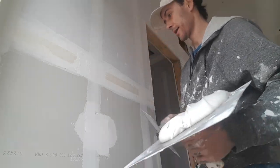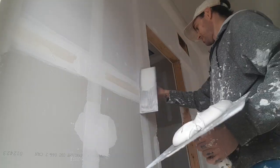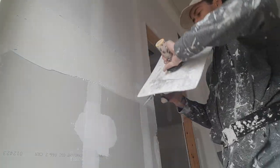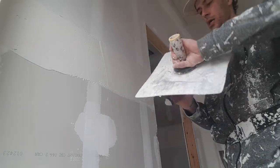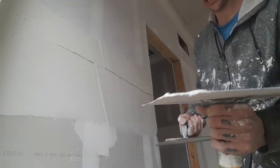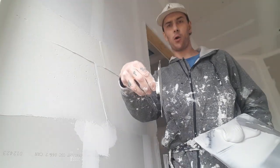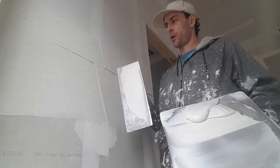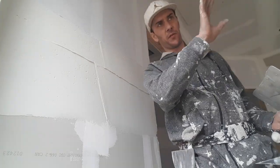This is how I coat a flat. Scrape it. I load a little bit at the top of the joint and a little bit at the bottom, and I'm using a curved 12 inch trowel. It's got a little curve in it and I'm able to do these joints in one coat as long as I make sure that the bevel is full.